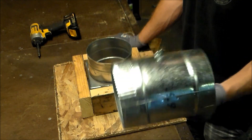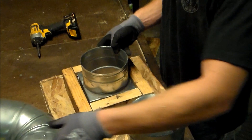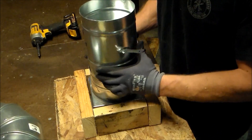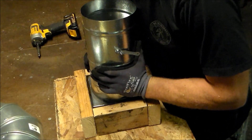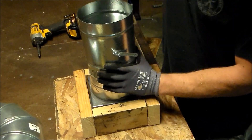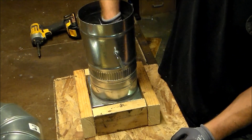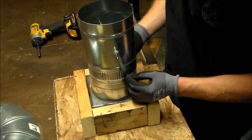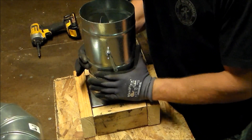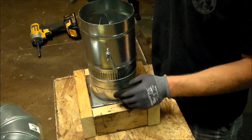In that case, when we install a damper — or even if we're going to install an elbow — what I always try to stress in all of my videos is that your crimp side is always going to be towards the inside of your ceiling box. You want this crimp side to sit right inside there, because air is going to come down through here and pass right by that seam. The concept is that it's blowing down, so your seam is lapped on the inside of this ceiling box.